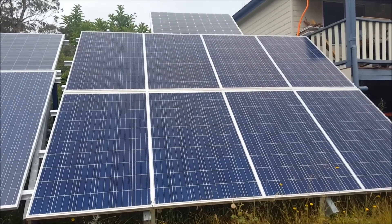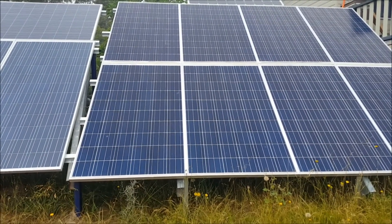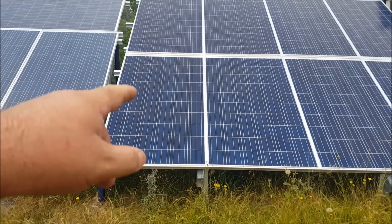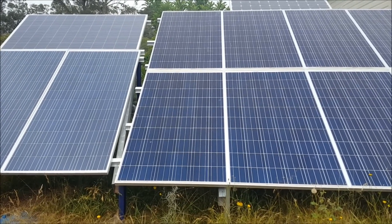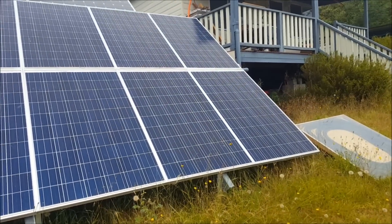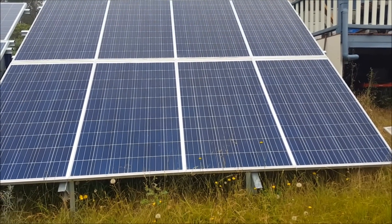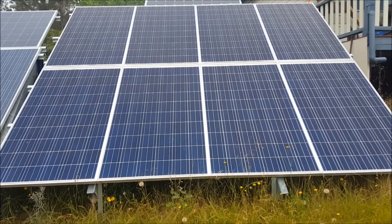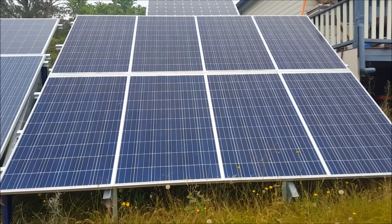Last year I bought 12 of these panels — these ones here. Mum and dad have got four of them. These were second-hand REC panels, manufactured January 2015. They'd been on a roof; there was a lightning strike nearby, the insurance company said all the electrical gear had to be replaced, the contractor replaced them and on-sold them to me. These are working fine. I was going to run just eight on my Giant Power charge controller, but that's got a max VOC of 145 volts, so I can only do strings of three panels.